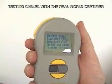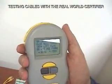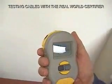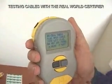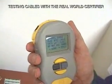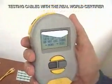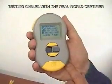It tells us to uncoil the cable. The tester can actually tell if the cable is coiled or not, because if it's coiled there's more crosstalk, and it makes the cable category be a little less than it really is. Here's really the first big difference from the other testers — how many cable installers use that last 20 feet as a coil, stuffed in the wall, maybe with a tie wrap around it? We'll show you the difference in performance if you use techniques like that.